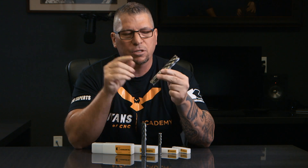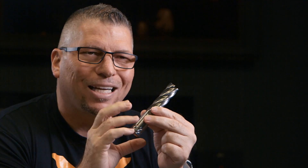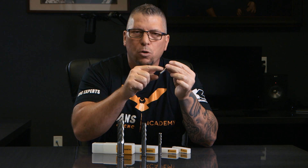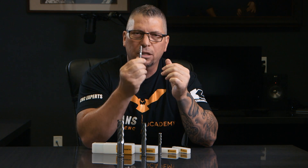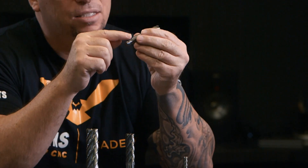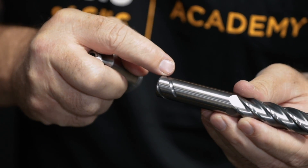The reason for this video: when I was going through the comments, I saw some people talking about the grooves and the holders. So I thought I should pop out a quick video to explain that the 3/8" has no safe lock grooves and goes into a regular end mill holder, but the half-inch, three-quarter, and one-inch have the safe lock grooves.